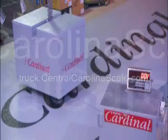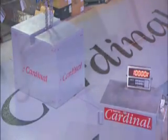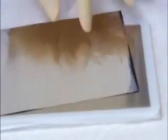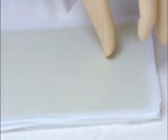The key to this enormous scale is a tiny component called a strain gauge, which sends signals to the scale's computer when compressed. They make the strain gauges from a laminate by bonding paper-thin sheets of nickel iron foil, epoxy, and Teflon in a press.